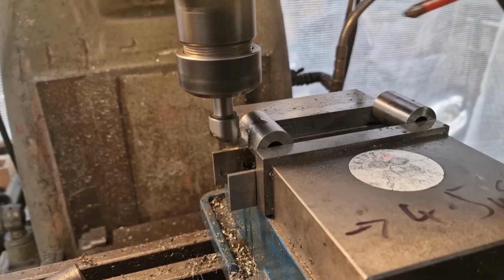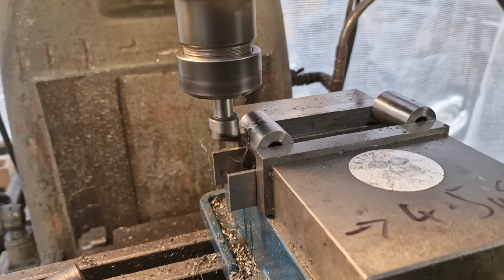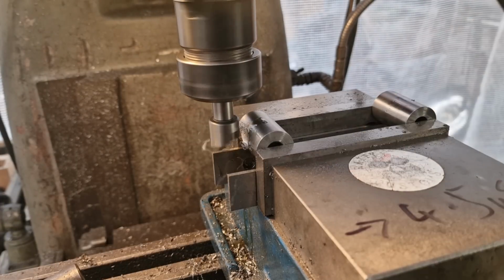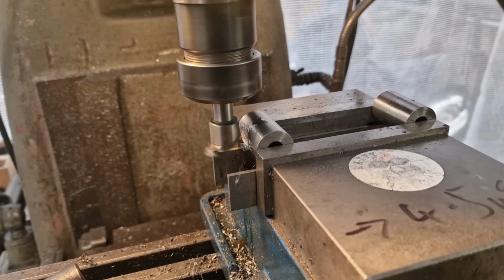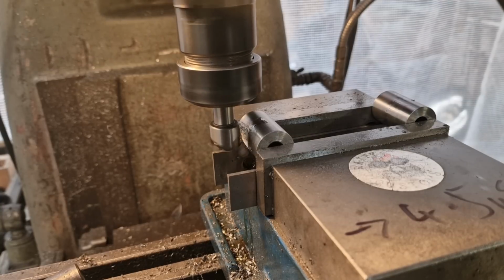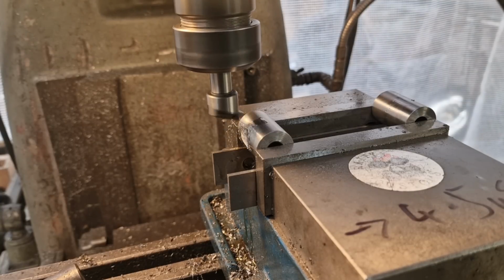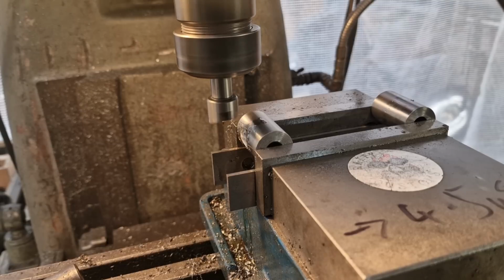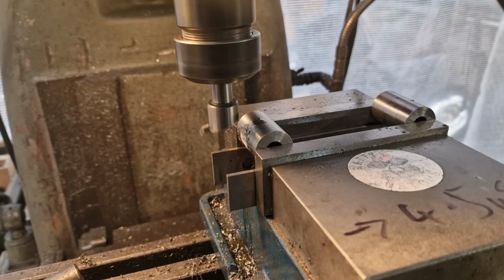So, on the second one, we're currently at 2mm. We need to keep moving it that way every cut, 0.5mm or 20 thou, and we'll stop when we get to 4.5mm. So, this cut marks 2.5mm, just there. And like I say, we'll just keep chipping away at it.